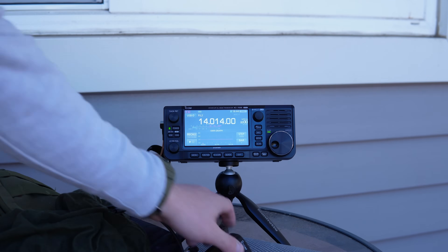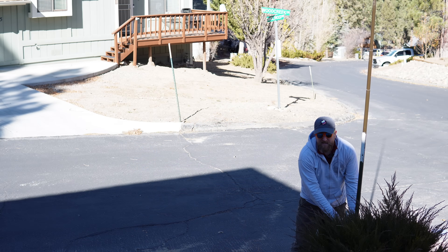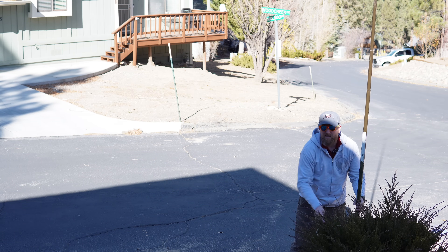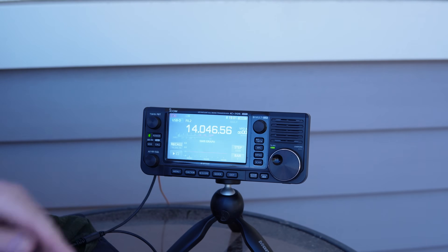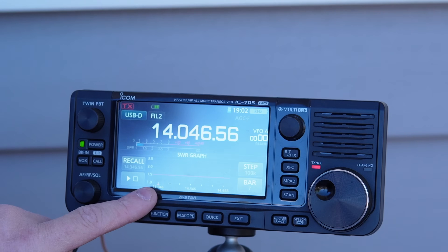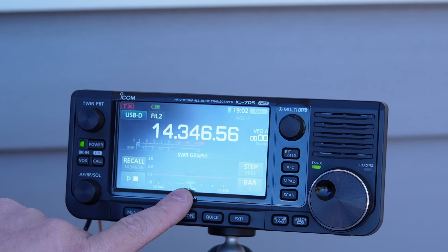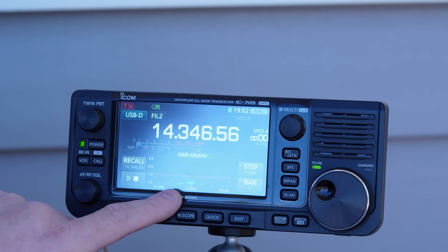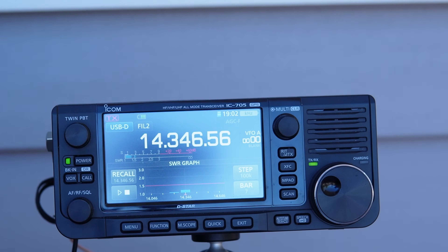Let's check it. That's the low side. This is one of those instances where you could connect it up to an antenna analyzer, but the 705 has a pretty good little sweep that we use. The low side of CW — if I start keying now, it's gone up one kilohertz to 14.346 right there, a low of like 1.2. So we're down in the 1.1 throughout the entire 20 meter band, which is exactly what we want to see. So that's spot on — dialed in monoband end-fed halfwave perfection.